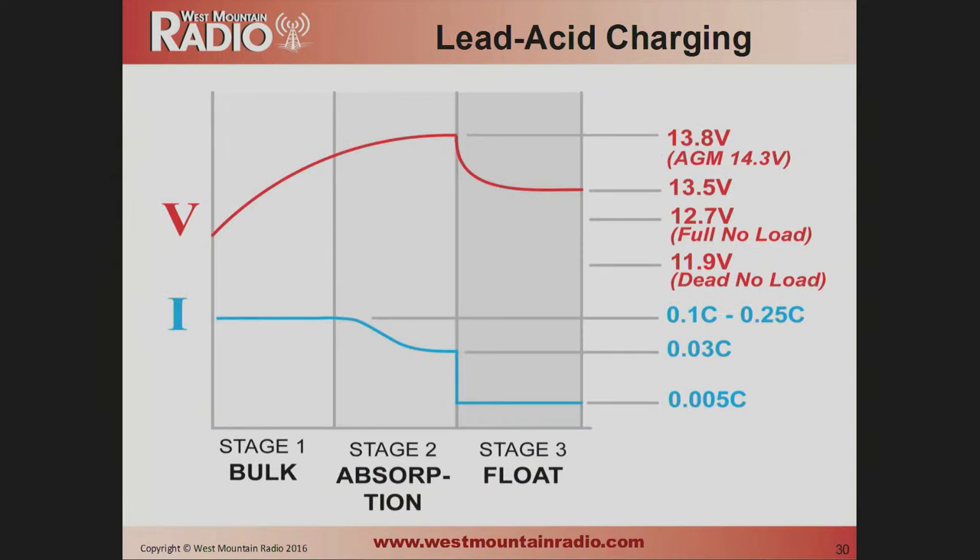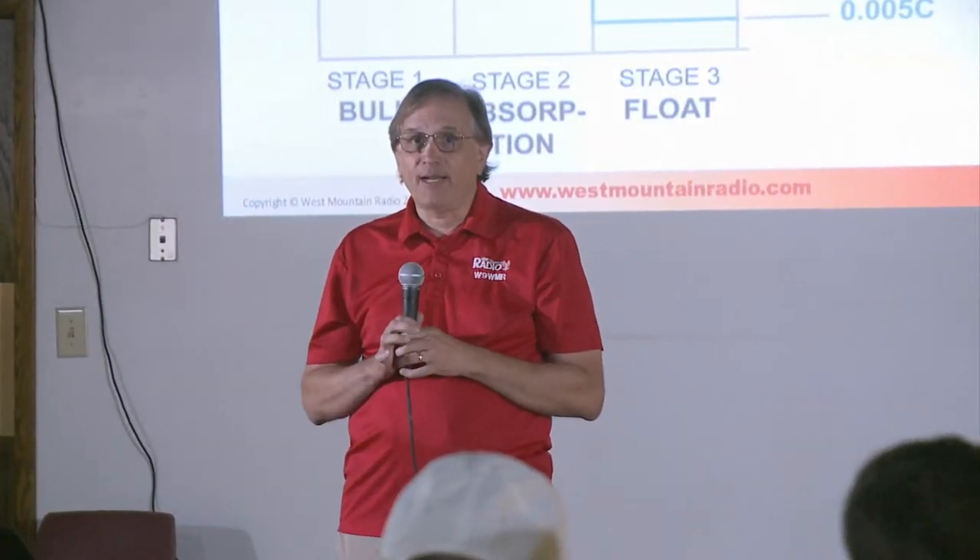A typical charging algorithm goes through several cycles: first you put in a fixed current and wait for the battery voltage to reach a certain level, then you hold that voltage and let the current drop. On a lead-acid battery you allow that low current to keep flowing — that's the trickle or maintenance charging. The lithium battery follows the same first two steps, but as soon as you get down to 0.05 C on the charging current, you want to disconnect the charger. This means you can't use a standard lead-acid charger on a lithium battery unless the battery has electronics that automatically disconnects it at trickle charge. Either use a lithium battery rated for a lead-acid charger, or use a charger designed for lithium.